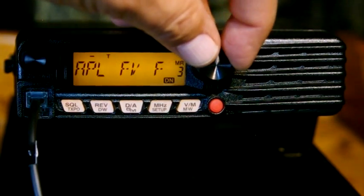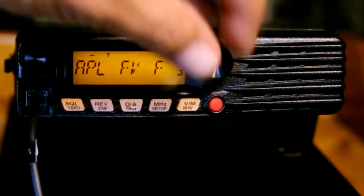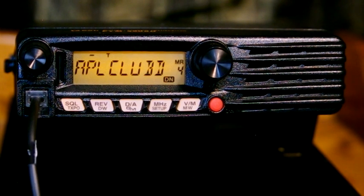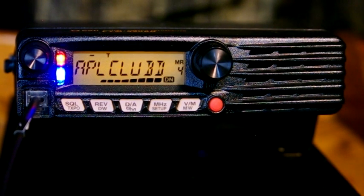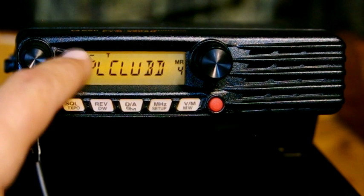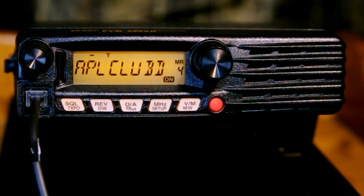I'm going to go up to the Appleton repeater which has digital. Switch to digital with one quick press of the push-to-talk. Now transmitting in digital — you can see the lower section blue and upper section red. That gives you a clear indication of whether you're working digital or analog. We'll show you more on our ham net tonight since we've got both analog and digital nets.